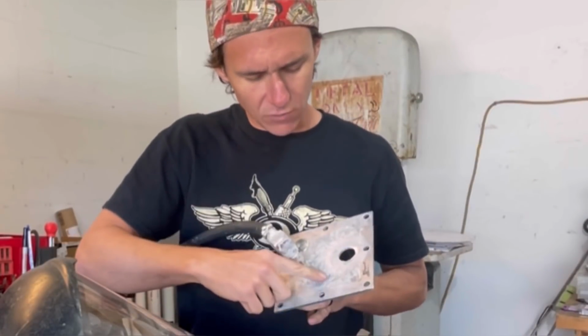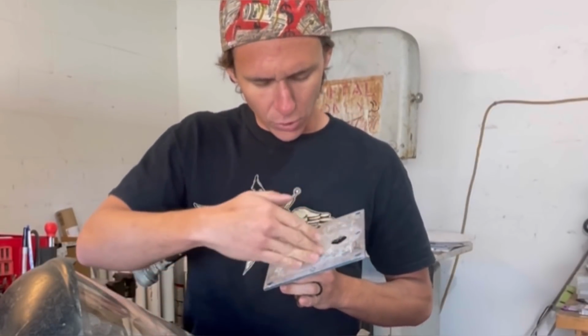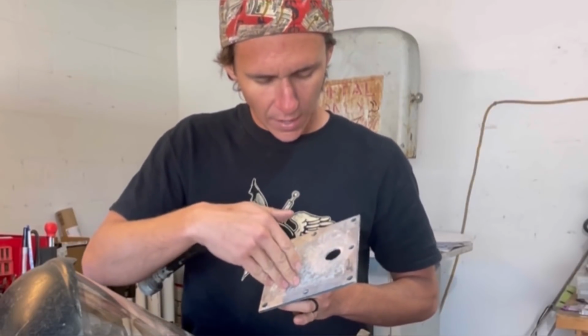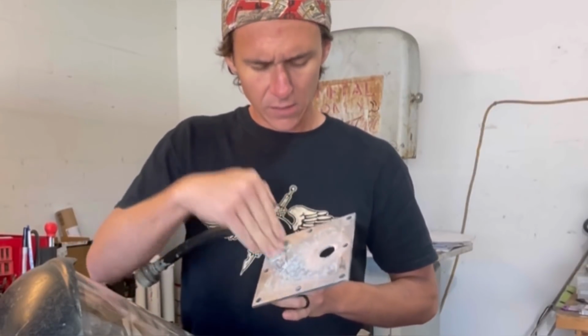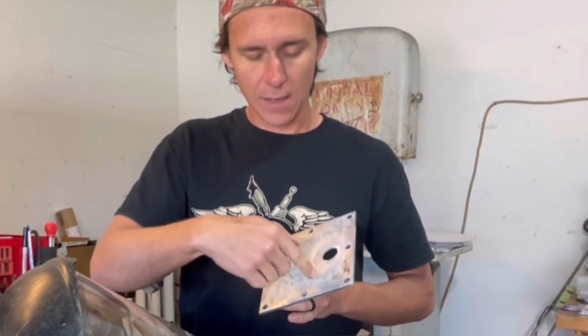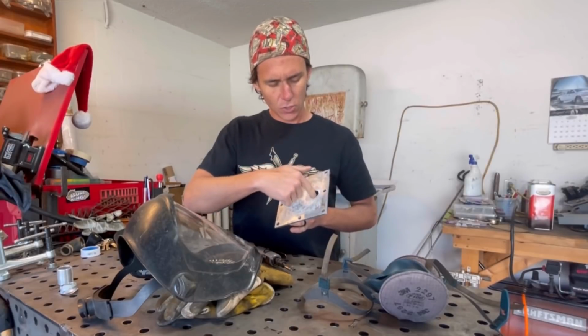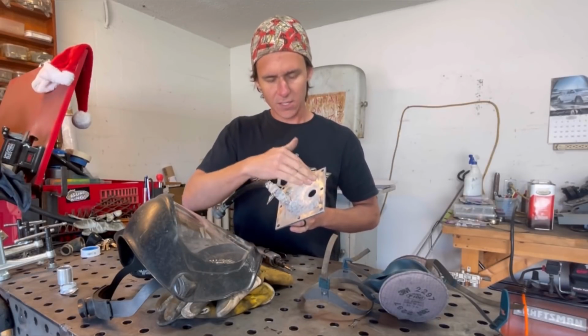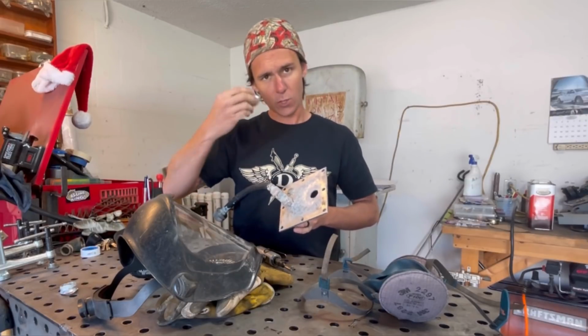That's just a little technique that I've learned over the years, especially when you have an uneven surface that you're dealing with. I didn't really go too crazy on the rest of it, but I just kind of wanted to demonstrate on camera how well that works to knock stuff that you have in pits maybe out of the pits. So let's go ahead, get the die grinder hooked up, give that just a quick wipe, get some acetone on it, and then we're gonna weld our bung on.